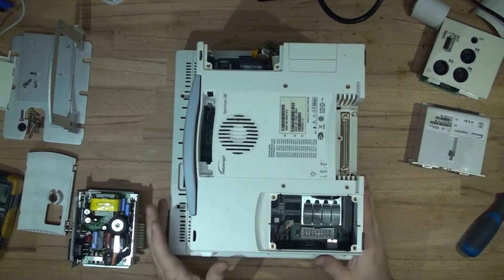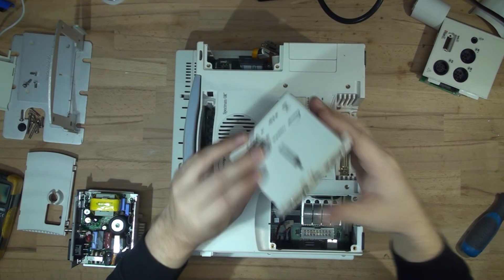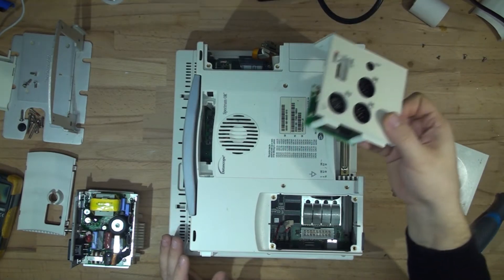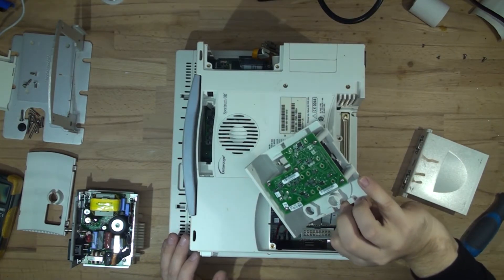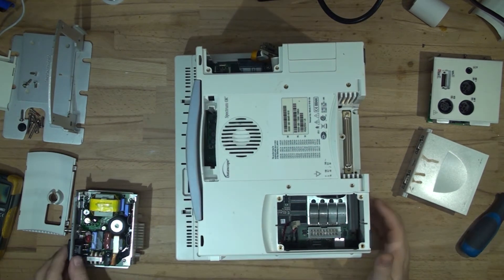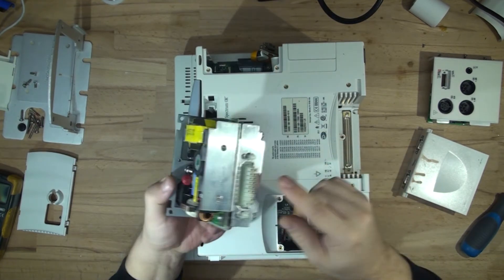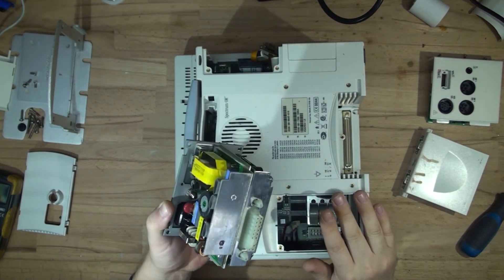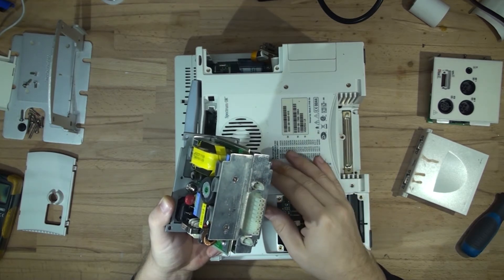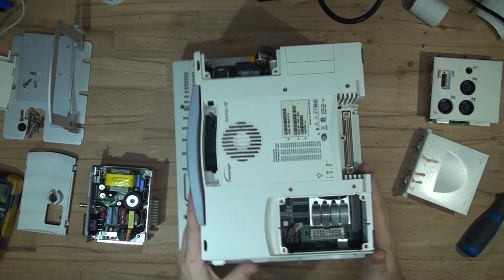I'm going to remove all the screws and all the sides and accessories before we take the lid off. I've removed everything as modules: a COM port module that plugs in here, and you have to remove it to undo the cover because the screws are just here. There's the patient module, which connects all the leads and test leads. There's another power supply module removed as well — going to check the caps are good, because a bad cap could drop 3.3 volts down to 2 volts, which would still run the unit but not properly.